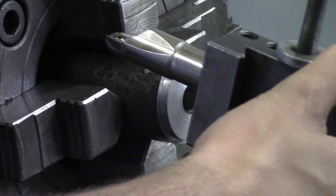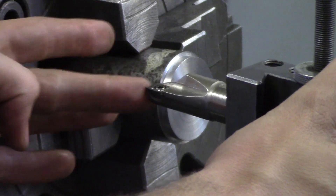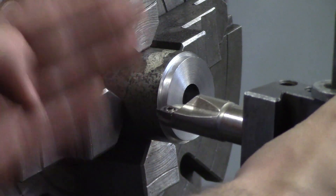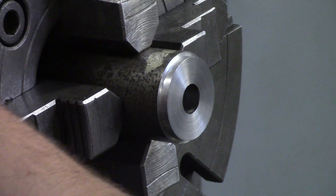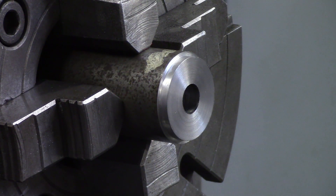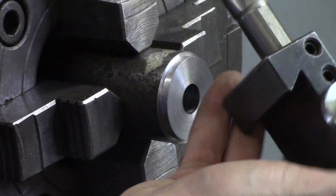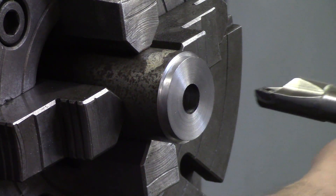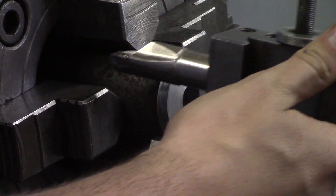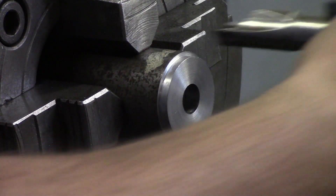Make sure your boring bar isn't cocked too much at one angle, because if the back or front-left side of your insert is angled when you face up at the final pass, you'll create a deeper or angled hole. You basically want to be cutting only on the tip of your insert — going down and away from your final diameter. The technique is: come in, cut, back off, move out of the hole, come back to zero, take another cut, back off. Don't drag across your hole as it's bad for your insert and the finish.